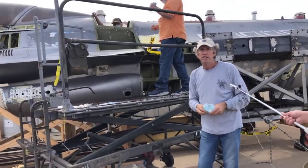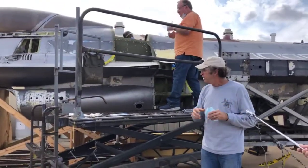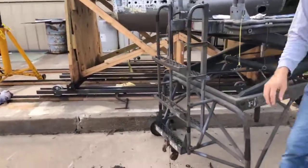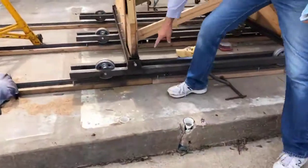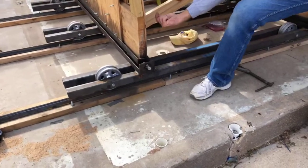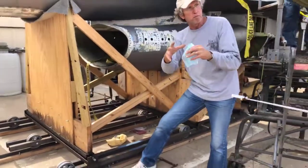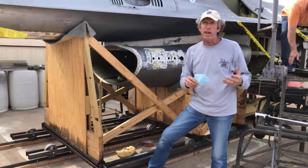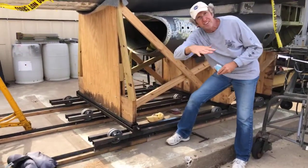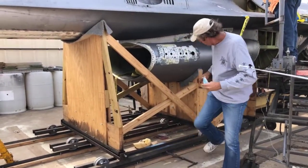So what was the hardest part of this process? Just getting it lined up and slid. We have a bunch of little screws at the bottom — three screws here let us slide it left and right. There are screws underneath in three places so we can tilt it. We can raise it. Smitty had done this before with factory tooling. We could come in with nose loads and lower this part of it down, slide it in, then rock it back up by raising the front end with these screws.